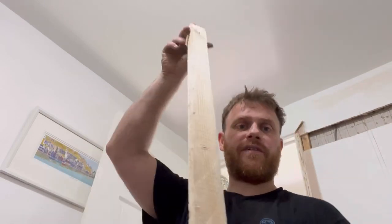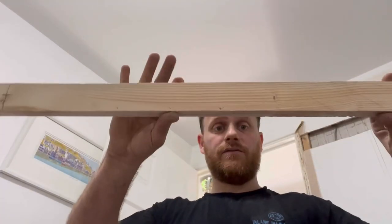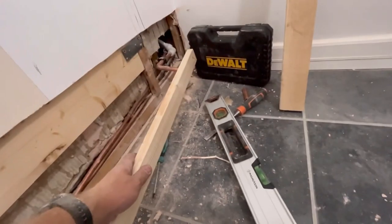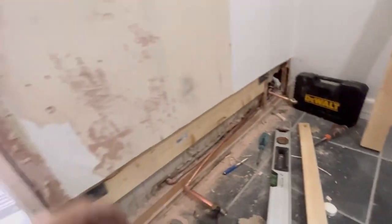Now here's a good trick if you haven't seen it — we need those pipe centres 680mm between each. With one of them level, I've got a scrap piece of wood and I've put two marks on it — one there, one there — centre of the wood — that's 680mm apart. Two 16mm holes for either side. Put that on and that's your template, and you can put your spirit level across the top to make sure it's level. That's the pipes in — that's my template wood. So what I can do is put that on either end of the pipe when I'm ready tomorrow, then put the spirit level on top and you can level your pipes when the plasterboard goes on — which makes it a lot easier.